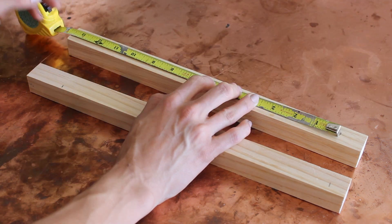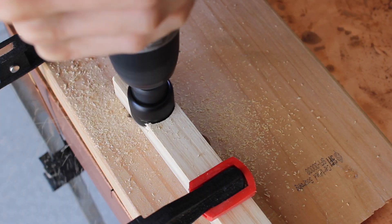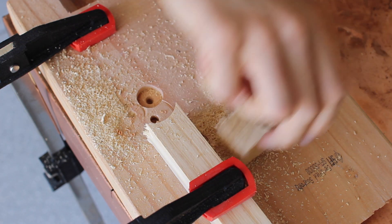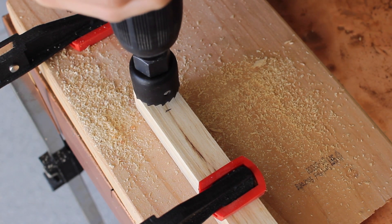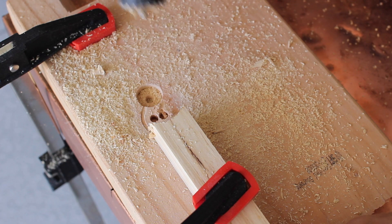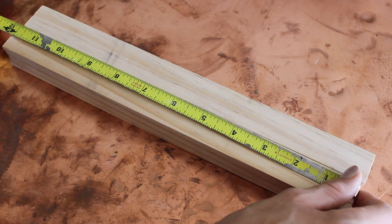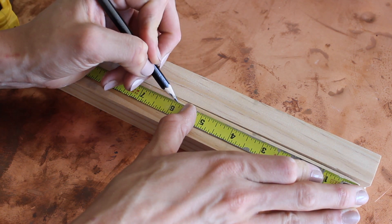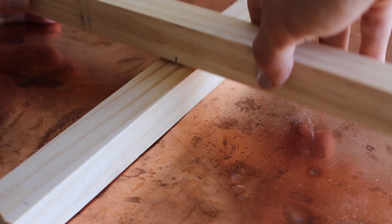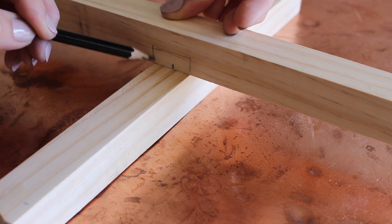I'm leaving a little bit of room on each end because I went in with my power drill and my hole saw bit — the same thickness as my round dowels — and carved out that edge so it's nice and smooth where the dowel can just fit right in. After I drilled out each end of those dowels, I went ahead and found the middle of the pieces because I'm going to be adding a half-lap joint.